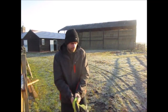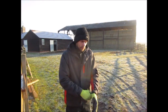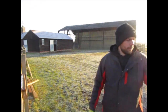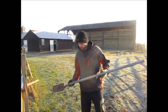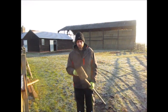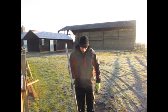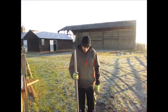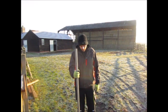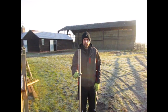It's been a couple of days since I made the first part of this video — it just got a bit too cold and I wanted to get on with the job. This is the second part, covering the rest of the tools. The grafting spade: it's a big, long, heavy-duty spade with a smallish blade at the end, only about four inches wide and ten inches long. That narrow blade gives you the edge to dig down and test for concrete. I like the height — it's a proper fencing spade — because if you get one half the height you're already bent right down, so it saves your back a lot.